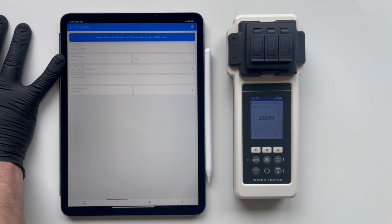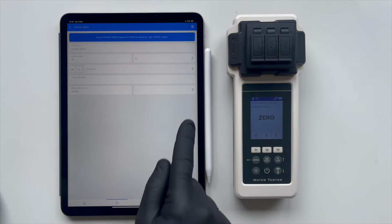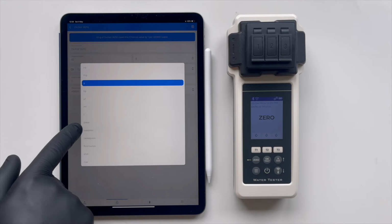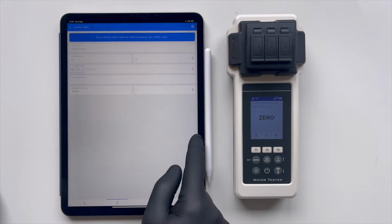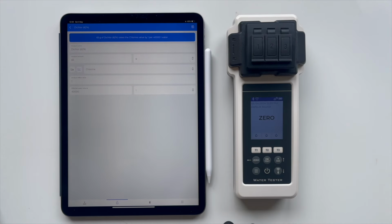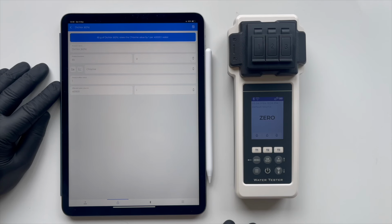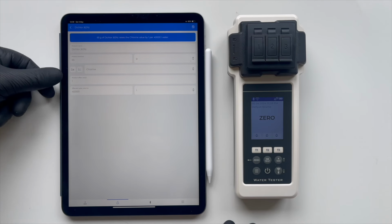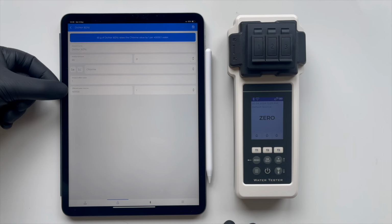In our case, it's in grams as we use a generic chemical, but you might typically use tablets. Select piece and how much it raises the chlorine level of the water. For example, in our case, adding 65 grams of Dichlor to 40,000 liters of water will increase the chlorine concentration by 1 ppm. This specific measurement helps ensure that we maintain the correct chlorine levels.